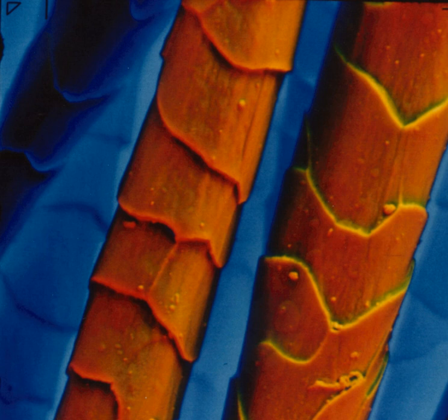The signal picked up by the anode is further amplified and processed to modulate a display screen and form an image as in SEM. Notably, in this design and the associated gaseous electron amplification, the product pD is an independent parameter, so that there is a wide range of values of pressure and electrode geometry which can be described by the same characteristics. The consequence is that secondary electrons are possible to detect in a gaseous environment even at high pressures, depending on the engineering efficacy of any given instrument. As a further characteristic of the GDD, a gaseous scintillation avalanche also accompanies the electron avalanche and, by detection of the light produced with a photomultiplier, corresponding SE images can be routinely made. The frequency response of this mode has allowed the use of true TV scanning rates, and this mode of the detector has been employed by the latest generation of commercial instruments.